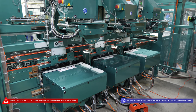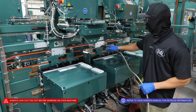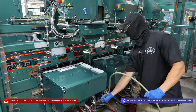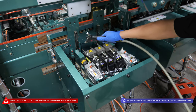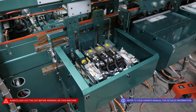At the end of each day, you'll want to just do a general blowoff, starting with the eyes. After you're done greasing your machine on the maintenance portion, you'll want to blow off the eyes also every 3,000 cycles.